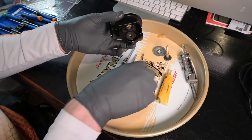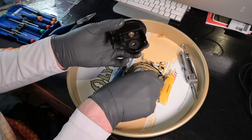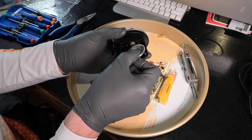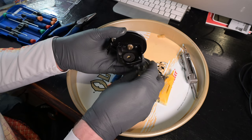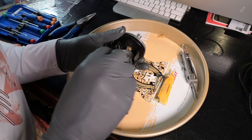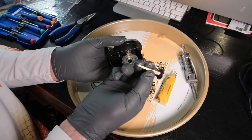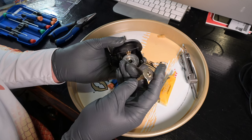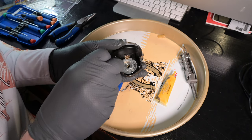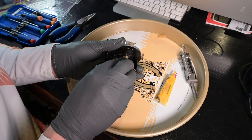You might be thinking, why don't I just put everything on this handle shaft and put it all in together? Well, if you do that, the main gear will interfere with your pinion gear and when it's assembled there's no way to insert that pinion gear with the main shaft in — as far as I'm aware. So now we set our main bearing back behind the pinion gear, lay it down on all our washers. We take our main handle shaft, which has a drag washer on the back — the shaft is keyed and our main metal washer is keyed, so we orient them to align and apply some pressure.